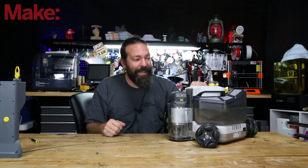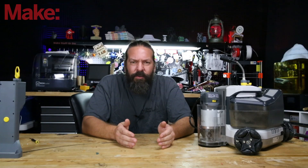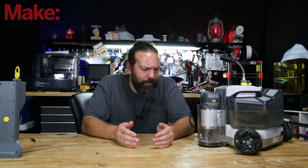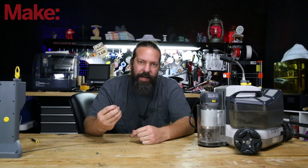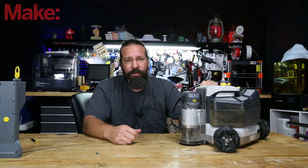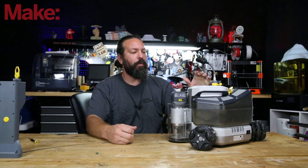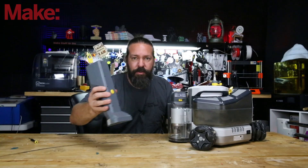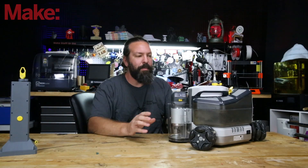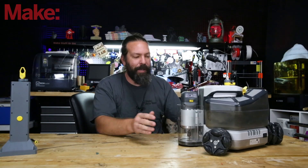But you can throw this in a duffel bag and carry it to a job site — so there's a trade-off there. Of all the selling points this machine may push, portability seems to be the one defining, really standout factor. It's got these handles, it's portable, you could throw it in a bag, take it to your job site, keep it in your car trunk, never even notice it's there. One thing I would have liked to have seen, since portability seems to be the main selling point, would be a way to store end mills, the wrench to take the end mills out, other collets, screws — because you need screws to screw these in — and even to store these. So maybe a clever way of attaching them on here in transit, or even just a cheap bag, would have been nice, but absolutely isn't necessary.